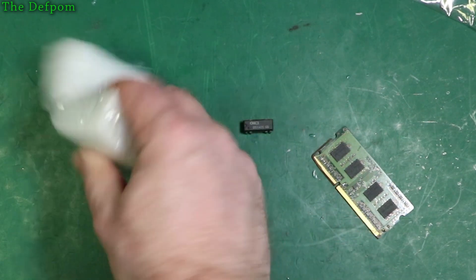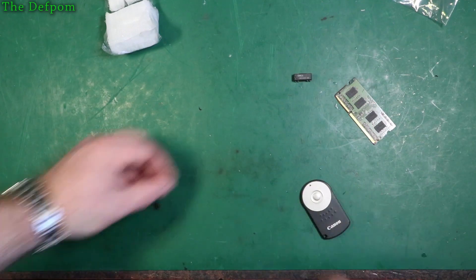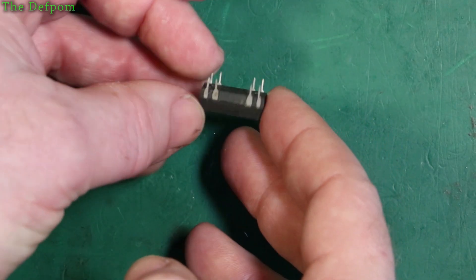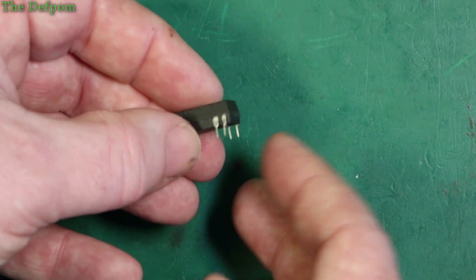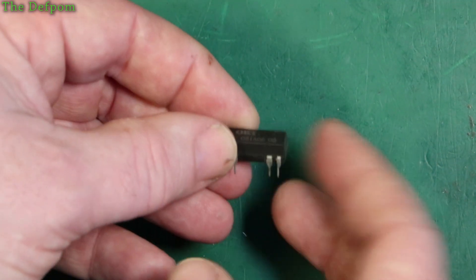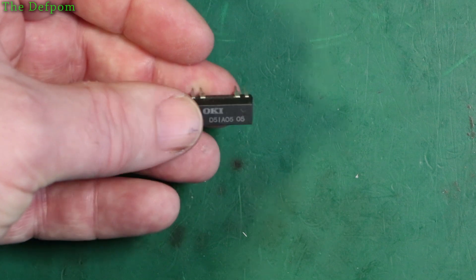One relay. I'm pretty sure I purchased more than one — I'll need to go and check this. No, I did only buy one — that was dumb, I was going to buy stock. Anyway I've got one now. So yes, basically it's a reed relay. You've got a coil and relay contacts in there. It's basically a reed switch like one of these things with a built-in coil so it activates it internally — a nice one-piece unit. You see these in devices sometimes, so that's why I thought I'd get some.